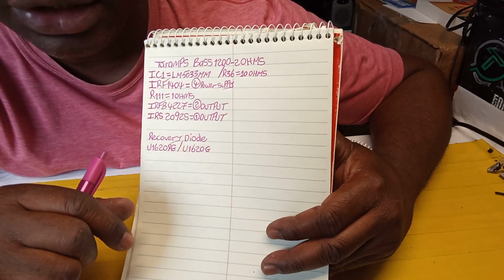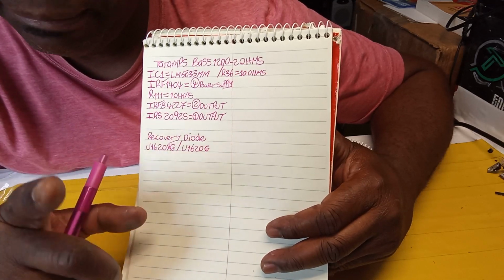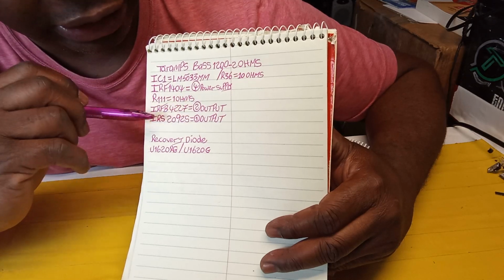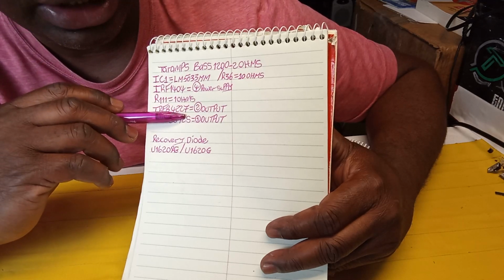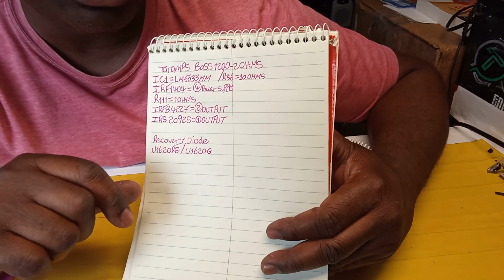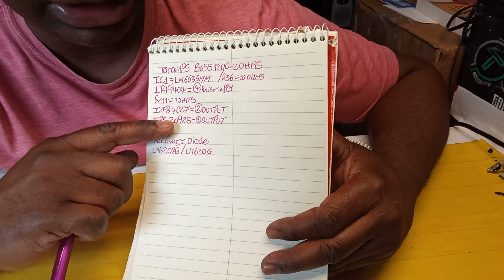And then, guys, after all that, the amplifier comes on. I try to turn it up, and I'm getting no audio from it, guys. The chip light was just flashing on and off whenever you turn it up. Anytime you have that problem, guys, listen: just go inside the amplifier, whichever amplifier you're working on, and replace the driver MOSFET, whichever one it uses. That's always the case with everyone I repair, guys. If you have a Taramps amplifier and it's flashing the chip light when you turn it up, just replace the driver MOSFET IC, guys. That is what's causing it.